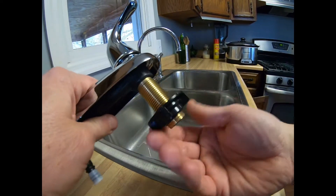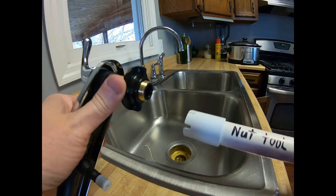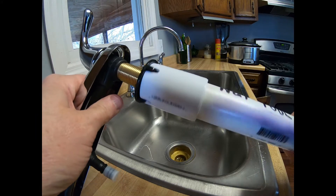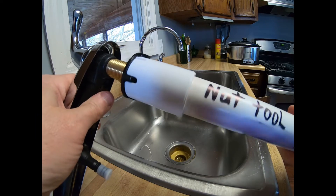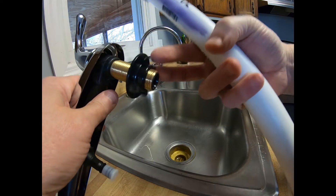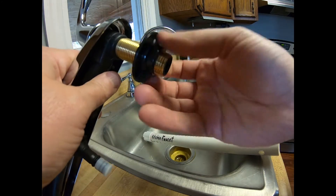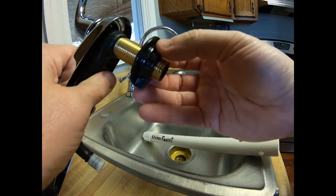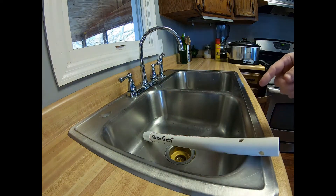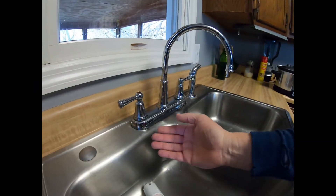I made a custom tool — it's a piece of one-inch PVC pipe with a union fitting on the end, and I cut grooves into it. This is my kitchen faucet nut tool. What holds the faucet in place is a nut underneath. This tool lets me reach up behind the sink, get it on there, and spin the nut on and off. Otherwise you have to get up behind the sink — it's very hard with pliers.